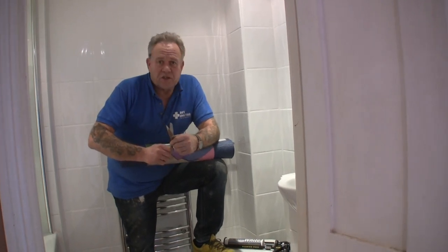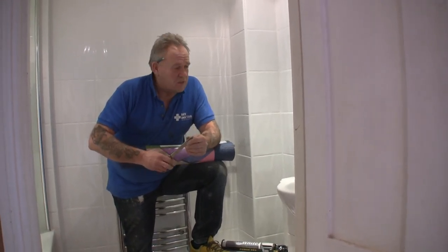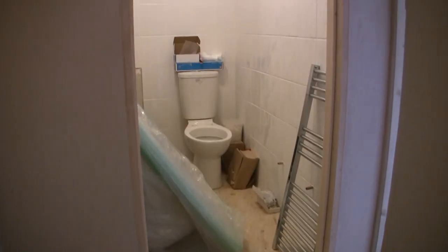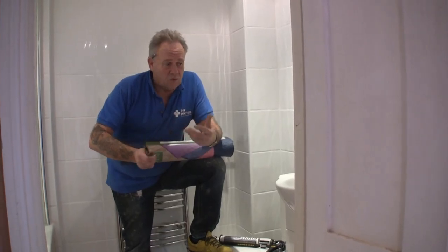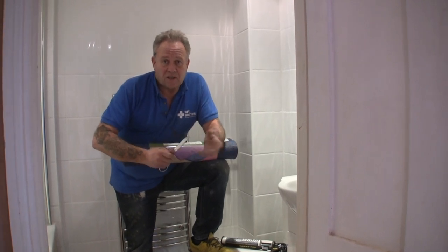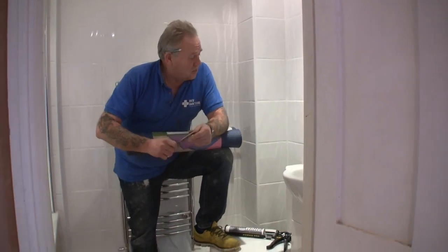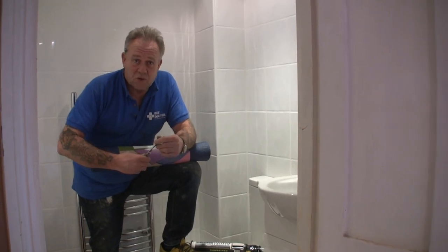We're on a little refurbishing job in a cottage, adding a couple of bathrooms, both of which you can see now. I'm in one of them and this cottage is very, very warm indeed. The result of that warmth, especially in the bathroom where there's so much humidity, is that condensation forms on pretty much every cold surface. The coldest surface in the bathroom, probably the house, is the toilet cistern because it's full of very cold water.